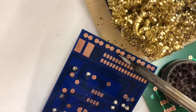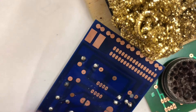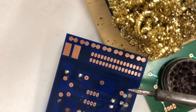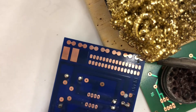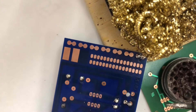We're going to practice on filling these in. It's not as shiny, so we're going to tin it some more, then add more solder. We're looking for a bubble — right here is my bubble on the bottom. I'm going to tilt this sideways, touch it, and add a little more solder to get it on there. It's hot already, so touch it and both sides are filled in already.